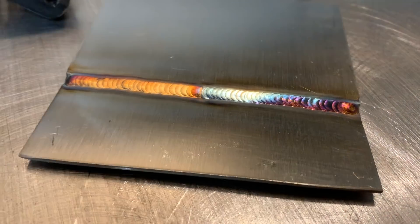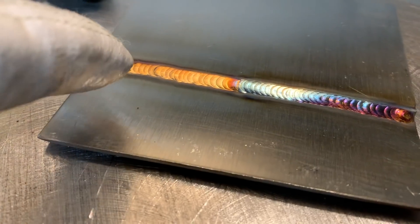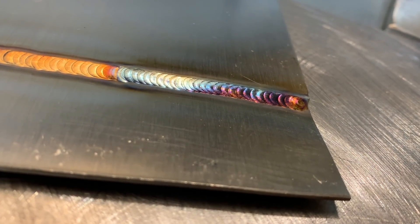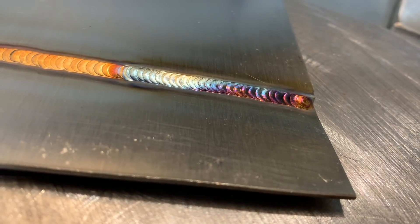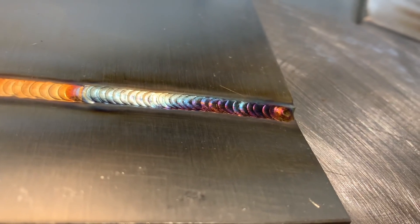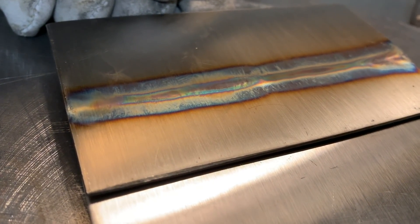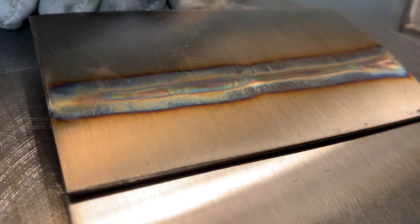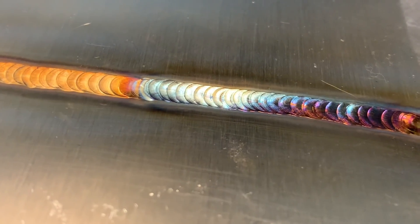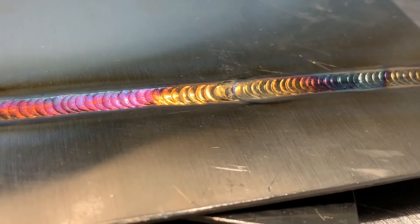So, there's the second half there. Unfortunately I got impatient — I should have let it cool down a little bit. The first half was a cool pass, the heat-affected zone is much smaller, and the color stayed more gold — that's what we're looking for. Second half I just went for it and it was screaming hot. If I had let it cool, it probably would have turned out better colors. Regardless, everything stayed relatively clean and in control for the most part. Consistency was all right — first half not that great, second half much better. On the backside you can see the tie-in was there; in the middle the heat-affected zone was pretty consistent, probably because I did not let it cool down. I definitely recommend letting your piece cool down between passes.